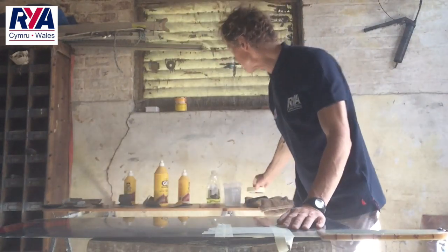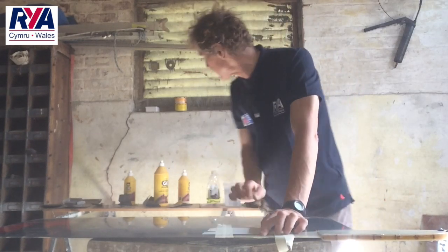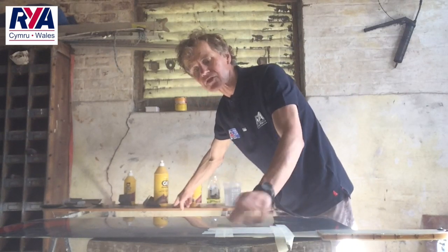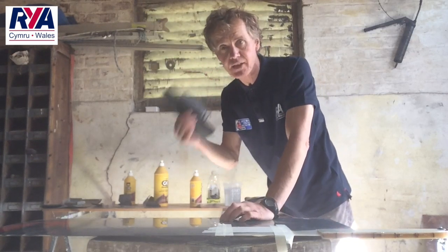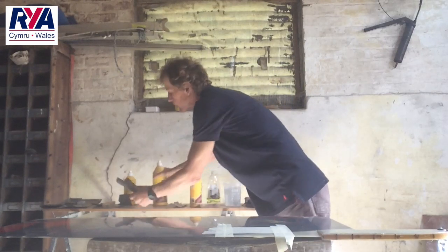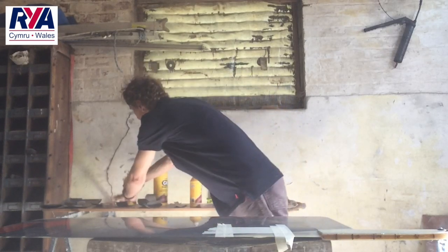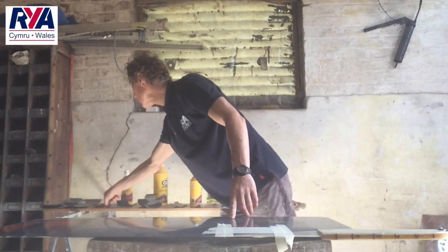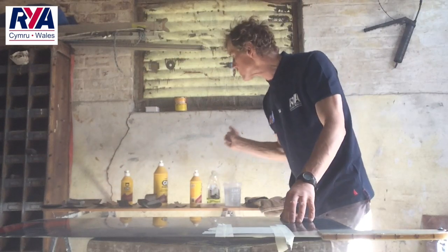So let's have a look at our finishing process — we're going to sand that down. I'm going to start off with a coarse sandpaper: 120 wet and dry, the black wet and dry that you can use dry or wet. Under there I've got a 280, then strips of 320, up to 400, 600, 1000, and even 1200 grade. So I've got all the grades running right through. This part of the process is going to take a little bit more time.